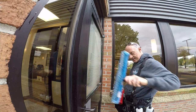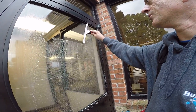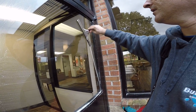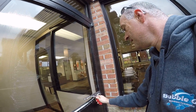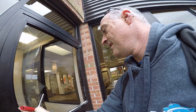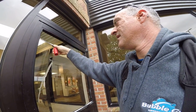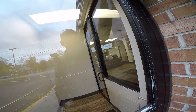Let's see if we can do the middles first on this one. Like we said, no other squeegee can do this except perhaps this type of squeegee. So we'll come up like this, square to the top, wiggle down, tuck that corner in, come up square — but you're going to have to bring it up like that, down like that, tuck that in, square, bring it up to get square. And you'll see that there's no detailing there, no detailing there. But you are going to have to hit the sill.